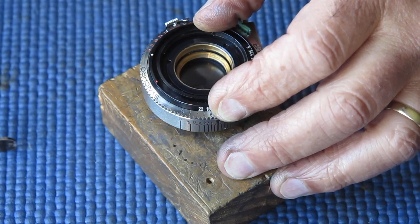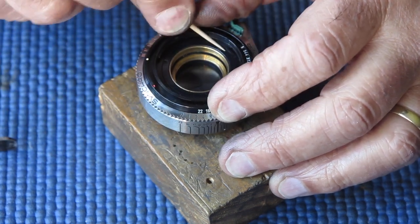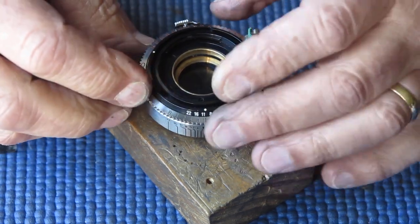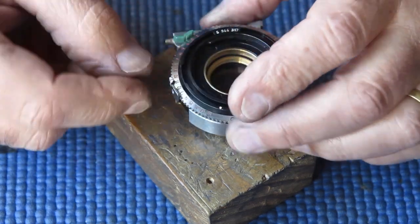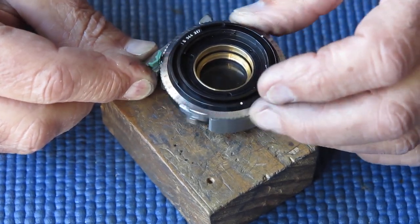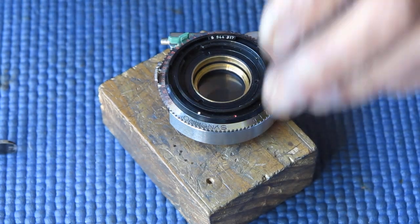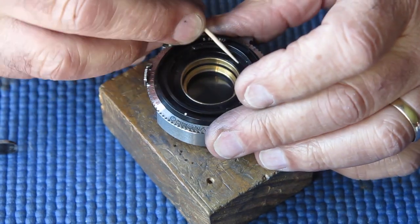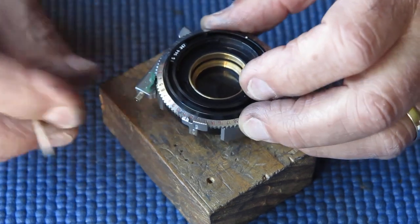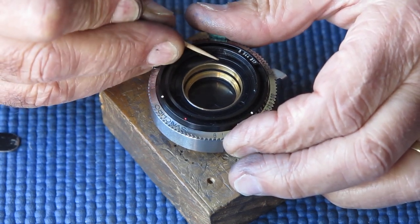5-blade diaphragm from, I think it was previously a 9 or a 10, I don't quite remember. But they moved to using a 5-blade diaphragm, shifted the aperture settings to the top of the shutter, and improved the spring tension on the coupling clip here, because the early Retina IIICs were a bit prone to coming out of mesh. Which basically means that if you're not watching what's happening when you shift your shutter speed and expect the aperture to move to compensate correctly, it may just stick there instead and fail to move, and you end up over or underexposed accordingly.